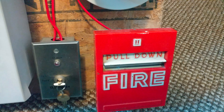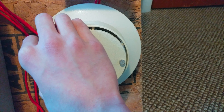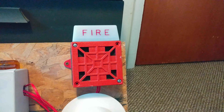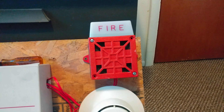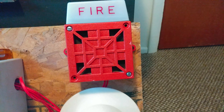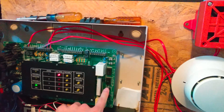All right. As you can see, we have zone one that has been activated. Let's go ahead and reset the pull station. I actually hooked the LED light on the key switch up to the signal circuit to get the notification points going — I don't know if any of you noticed that. Oh yeah, here's the model of this pull station — it's the S-464A pull station. So yeah, that was the pull station.